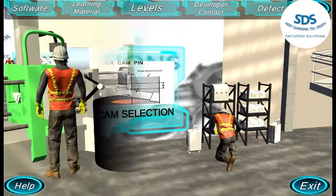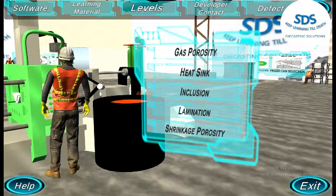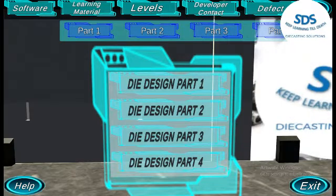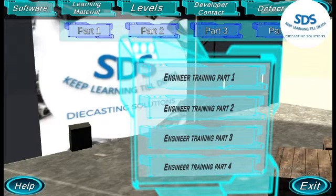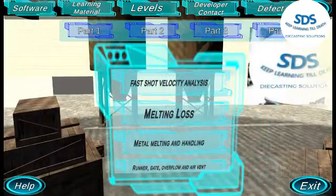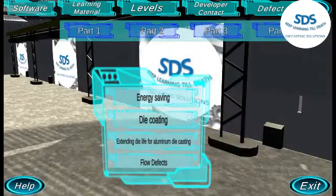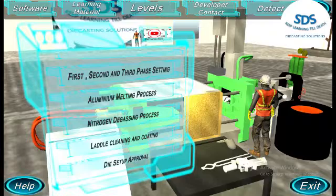You can learn how to troubleshoot casting defects — causes and remedies. You can find logical solutions for die modification. You can generate die design and HPDC machine parameter reports with a single click — no need for manual calculations. You can do a PQ2 analysis to check compatibility between the die and the HPDC machine. You can also predict whether your die will flash out metal or not.